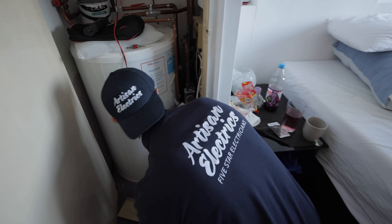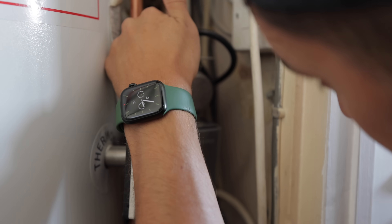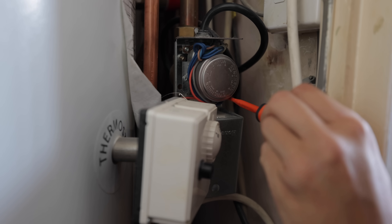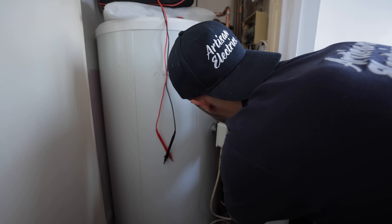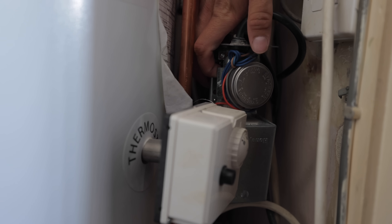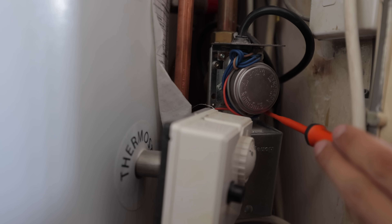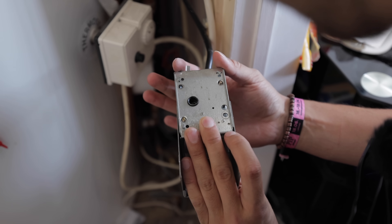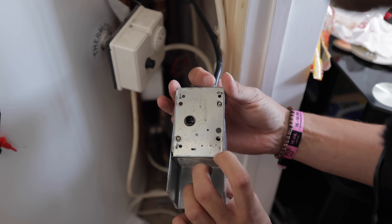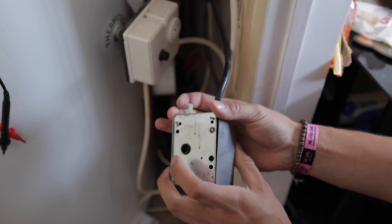I'll nip the front cover off this two port valve. It just looks to me like a faulty two port valve. What I can do is try and pop it out. That looks like someone's already had it partially off — see that screw there? That screw is already out, I didn't take that out. I think therein might lie the answer. There we go, now it's releasing. Interesting — so now it's releasing. That's how it should be when you turn the power off.